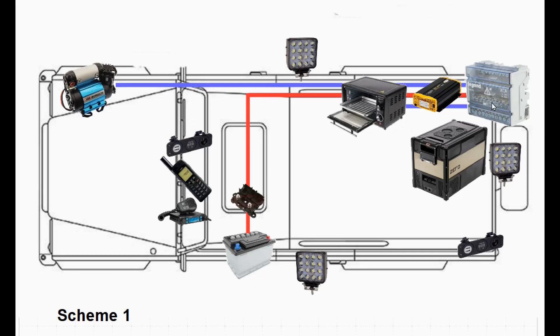It really is quite complicated. Quite apart from the complexity of taking all of the cables back to a central hub, there's then the question of the cable sizes. If we look at the case of the compressor, the most direct cable route is obviously from the battery straight to the compressor, whereas here we've got to go back to the DC hub and out again — we may have double the cable run, although it could be a great deal more. The size of the cable is governed by voltage drop considerations, and if we've doubled the cable run we're going to have to double the area as well to get the same voltage at the compressor. So we've immediately increased the volume of copper by a factor of four, meaning what are already large cables are going to become really quite massive.